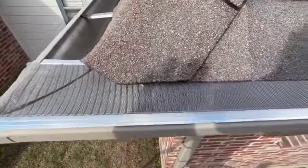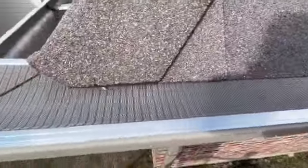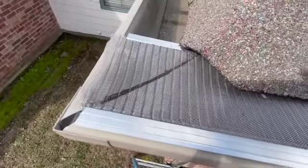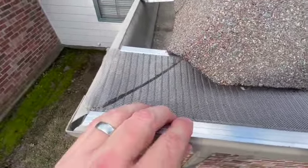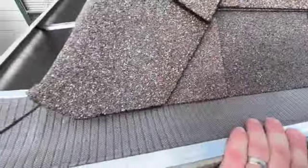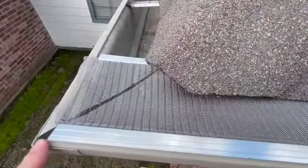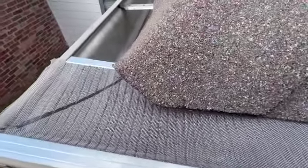We laid our first piece in. This is for five-inch gutters, which I believe is standard, though there may be more than one size. This piece has a lip that's tucked inside the gutter so it's solid in there. I had to lift up the shingles to shove the back piece in, and on these outside corners I'm going to have two angled cuts.